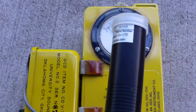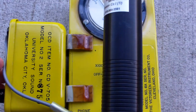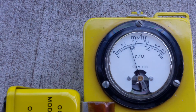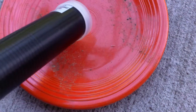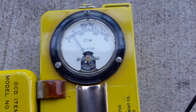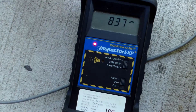When testing an object to see if it's radioactive, it's important to have the sound on. It is also important not to move too fast — as soon as we're off scale, adjust the meter accordingly. You cannot move too fast; slow is how you do it. The same is also true with the digital model. Slow wins the race.